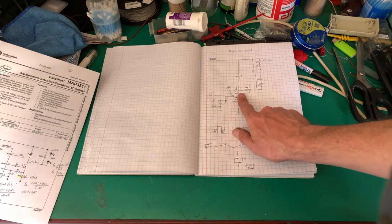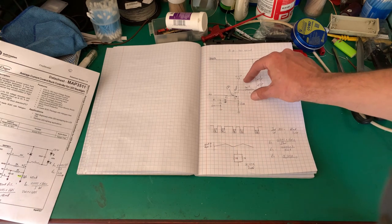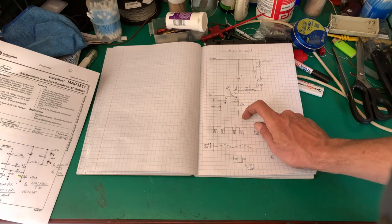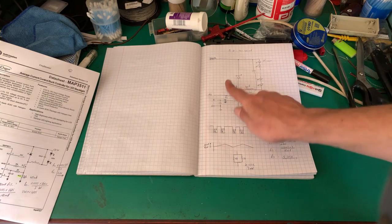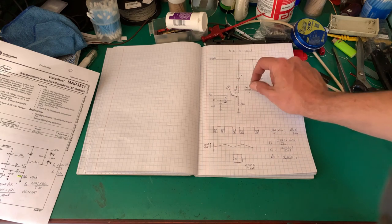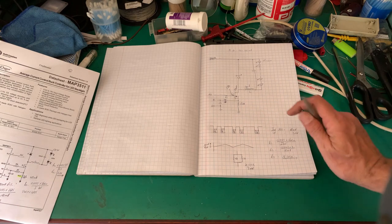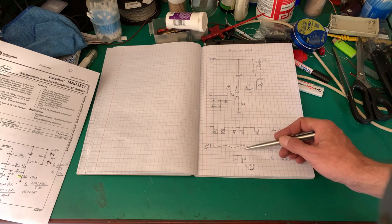The FET will switch off for its fixed off time. That magnetic field will start collapsing. Great, it will drive more current through to power it during that off cycle. The FET will then switch on again, and we'll have the magnetic field building up, and so we would see this waveform at the bottom. Notice it's never going to zero.